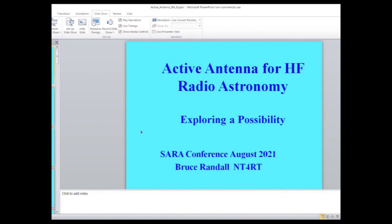Okay. As a matter of fact, the Hicks paper is one of my references on that. And looking at the Gali ICs there, notice that the Hicks dipoles were fairly large. So they were essentially a broadband dipole and a lot bigger than that. Yeah. And as the antenna gets smaller, the benefit of going to high impedance becomes significant. For a larger antenna, up closer to 40 megahertz, using a different preamp arrangement would probably be profitable. But down at the 20 megahertz end, with that small of an antenna, the high impedance preamps do give a lot better performance. Okay, excellent answer. I haven't looked at the problem from that standpoint of a very short dipole. The LWA dipoles are a couple of meters long. You're talking about something shorter. So you might be right. I think your answer is right on.